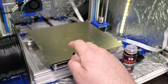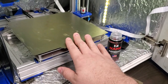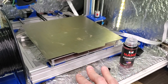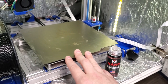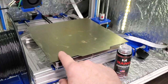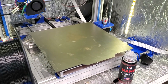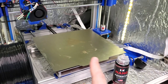I just figured I'd post a quick video showing you how to apply it. This will work with ABS, PLA, PETG — literally any material type; I haven't found a material it doesn't work well with. It's also great for putting down between PETG and PEI if you want to avoid any possible damage to the PEI surface, or even polycarbonate-type sheets. Hopefully this is helpful — I'm going to get the next set of Hero Me parts started right now.